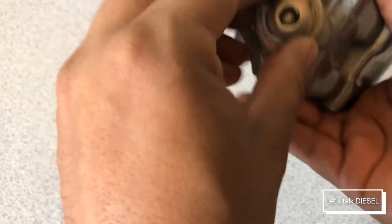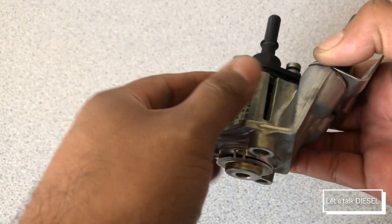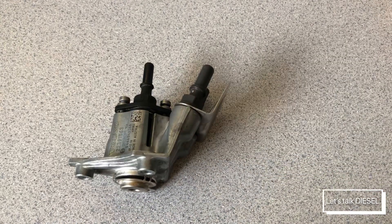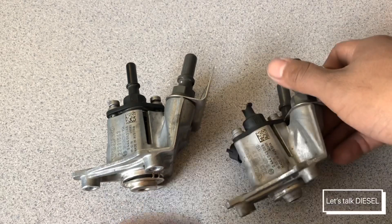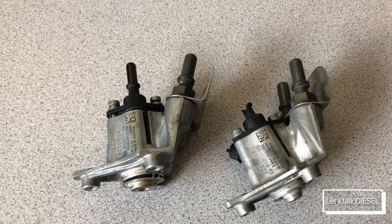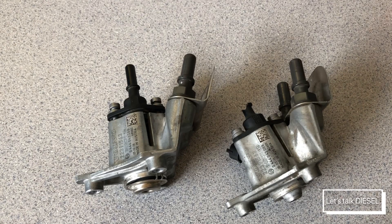This part is really important — it protects the injector from direct contact with the area that gets very hot at the bottom of the DPF. This is how you disassemble these parts. Note that Volvo is the only brand I know still using this system with coolant flow. Freightliner, Kenworth, and International are using the new system with just one injector and no coolant flow. I'll talk about the pros and cons in another video. Thanks for watching — if you liked the video, please leave a thumbs up and I'll see you in the next one.